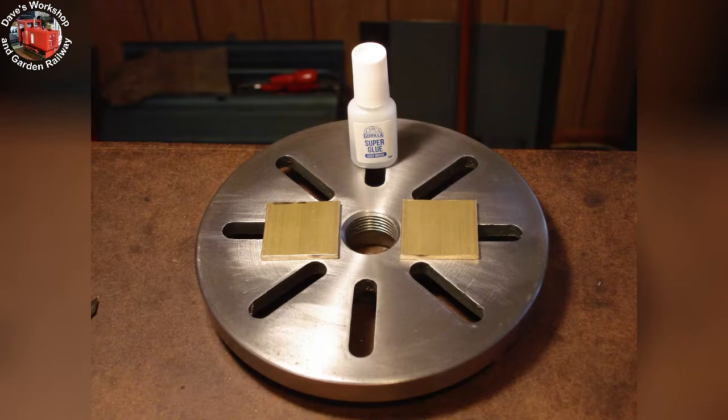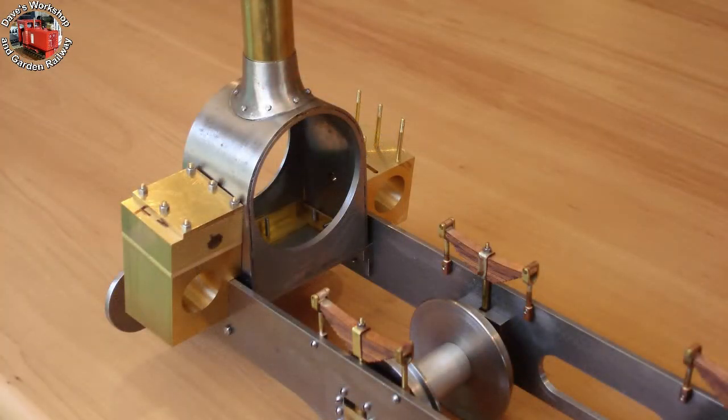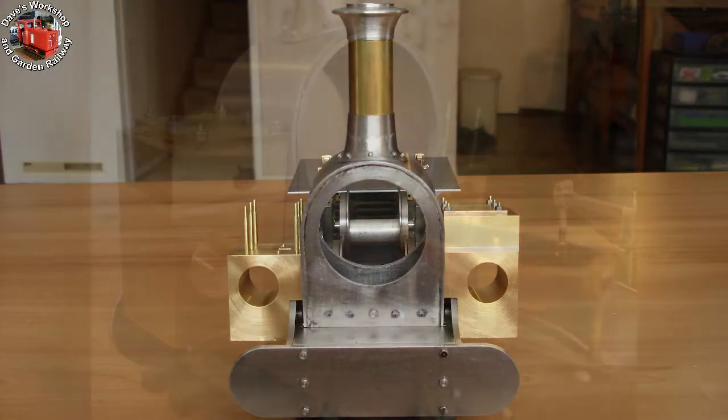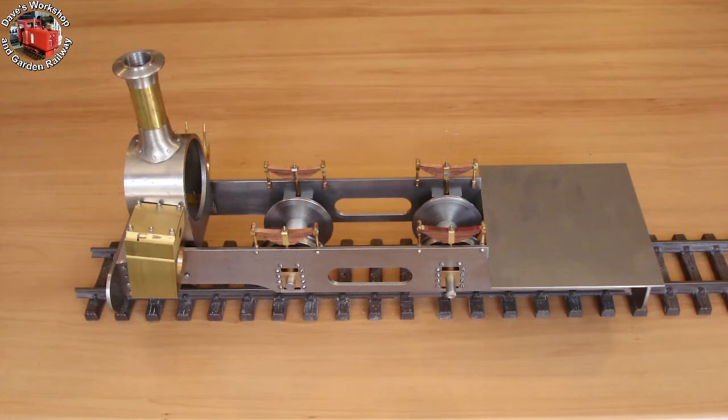Port face pieces mounted to the faceplate for skimming down to 0.1 inch thickness. The port pieces were then milled to size on the edges, and then set up with the steam chests and drilled through 2.5mm diameter for the studs to pass through. All the cylinder pieces are screwed down, showing how much material needs removing to create the distinctive profile — I am looking forward to that. Thanks for watching.